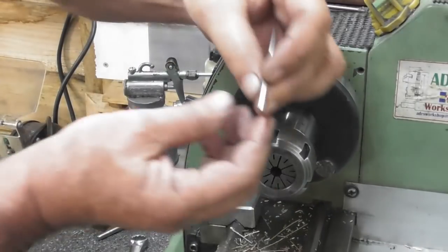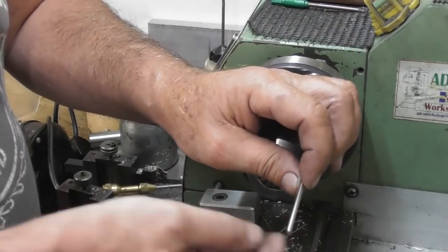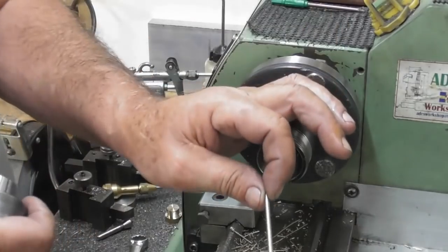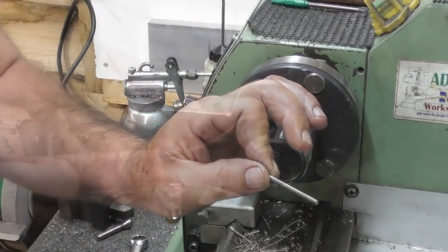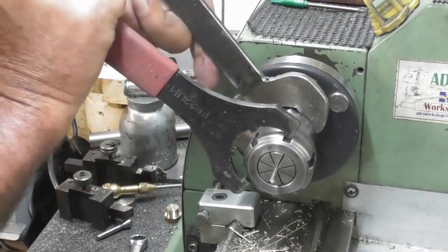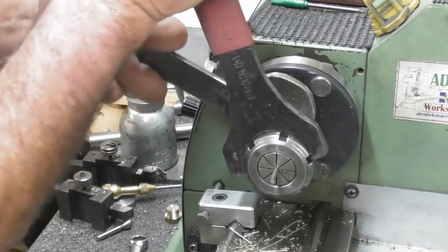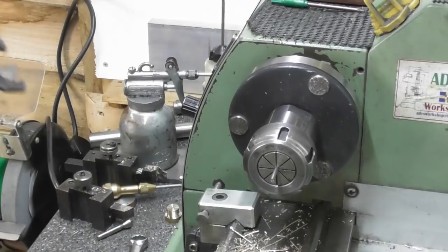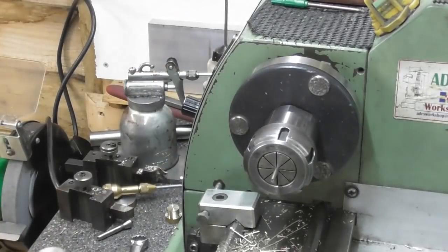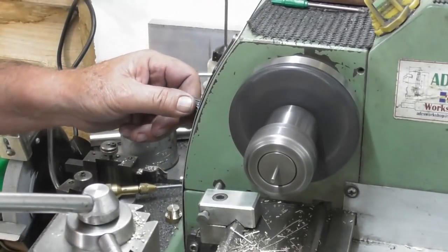So this is the rod that we're going to make the piston rod out of, shall we call it? So I need to find an appropriately sized collet now. My 3 to 4mm collet fits nicely with a, there we go, 1/8 diameter, or just under. I think it was half thou under an 1/8. And there we are. Let's just check it's running nicely. Beautifully.